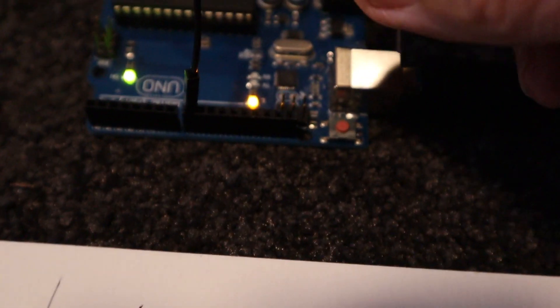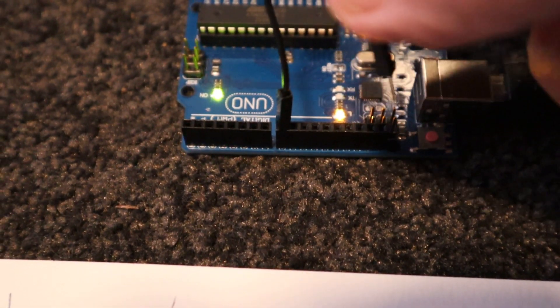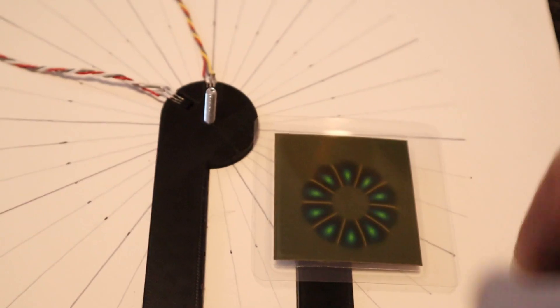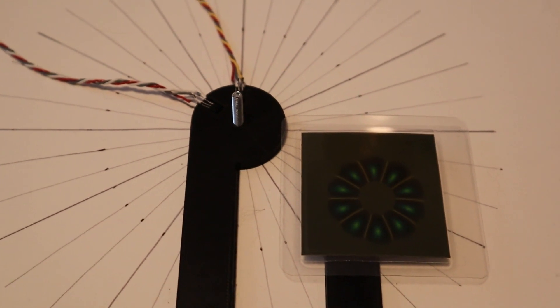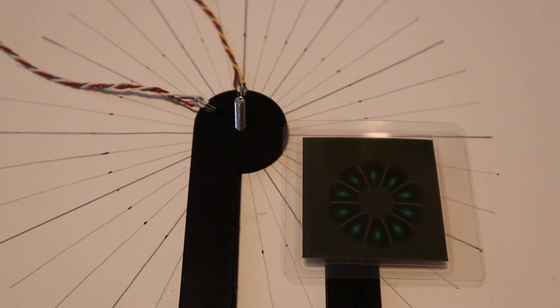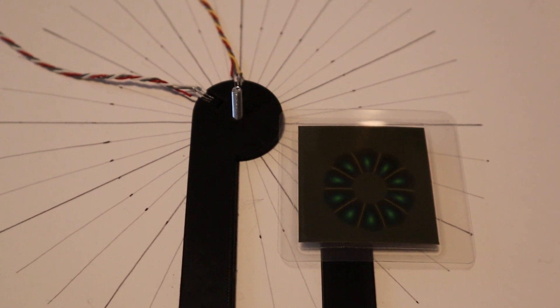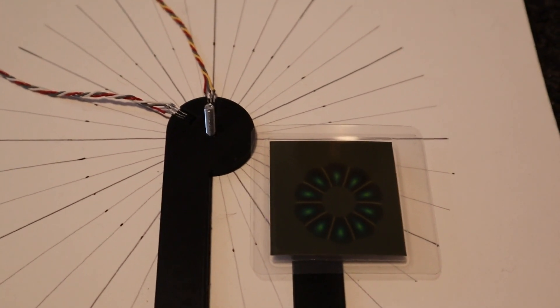Calibration is fairly simple. All we do is add a short to pin 8 of my Arduino program to ground, then rotate the magnet arm a few times, and then remove the short. Calibration values will appear on the screen when you do that. If you want to avoid having to calibrate each time, you simply write those values into the Arduino header code and you'll never have to calibrate again.